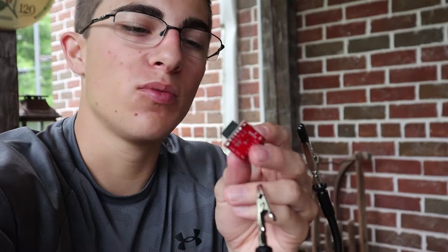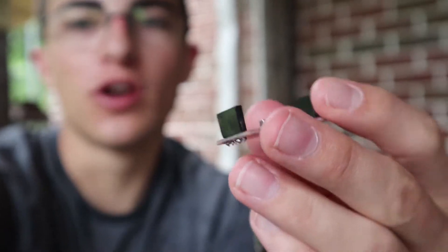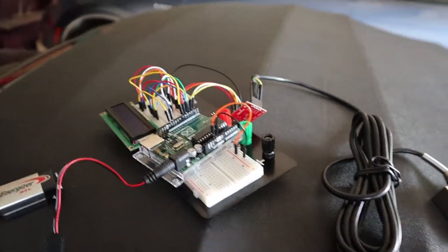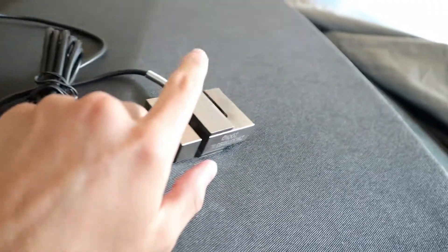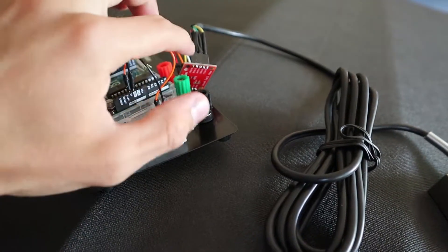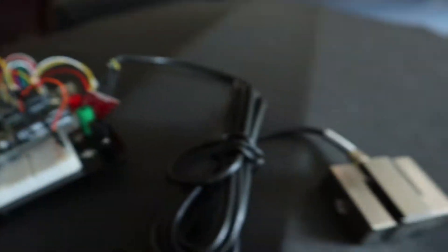I just finished soldering up this little piece here. I put these two little terminal connectors on each of these ends because it did not have those there before, and that's going to make it a lot easier to actually connect the wires from the sensor into this little HX711 board. Right here is the setup — we've got an Arduino Uno that's going to be powered by this battery, going to an LCD screen, an S-type load cell, and an HX711 amplifier. I had to do some soldering earlier to get these terminals on here for easier connection to the load cell.